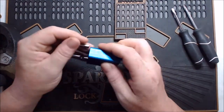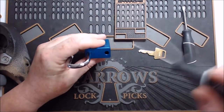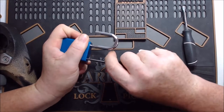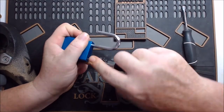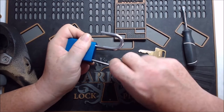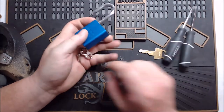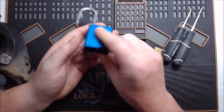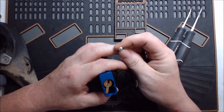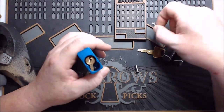There really isn't any gotcha with that — it won't damage the lock, so don't panic if that happens. First thing you do is open the lock. Down inside this particular one, we've got a Phillips head that has way too big of a head for the size screw it is, and my screwdriver is way too small. You probably want multiple sizes of screwdrivers. These two pieces will come out first, and then the screw will fall out of the bottom. As you can see, there's Loctite on it making it difficult, and it's a really big head that strips out really easy.